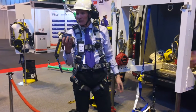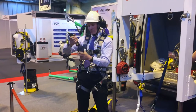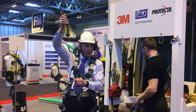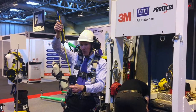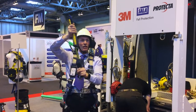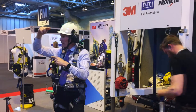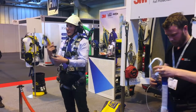There are various ways we can do that. We could substitute the standard lanyard for a self-retracting lanyard. The beauty of these systems is that with this one that attaches onto the harness, the effective working length of the lanyard is always at the minimum length. So in a fall situation, this locks off very quickly, minimising the free fall distance and therefore minimising the forces. If we've minimised the forces, the shock absorber isn't going to deploy much at all. In a real life situation, these lock off almost instantaneously. In practice, even with some shock absorber deployment, we're looking at arresting the fall within 300 or 400 millimetres.